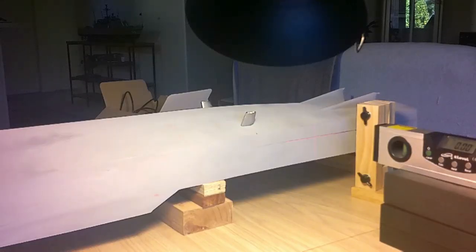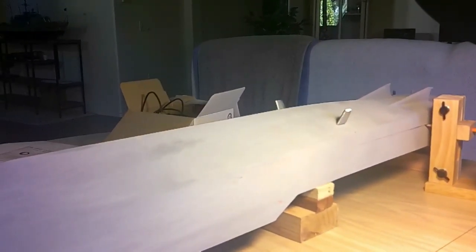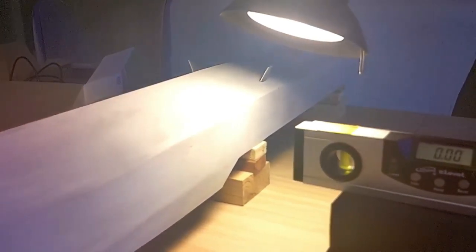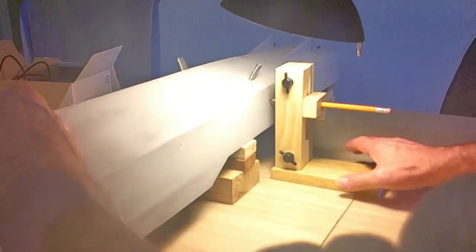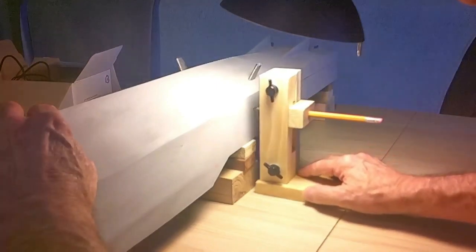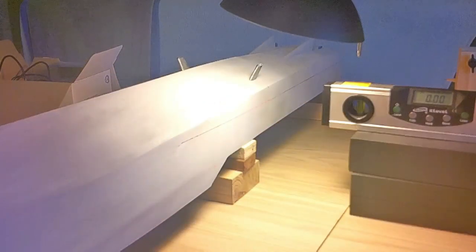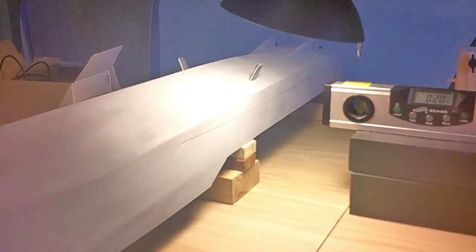Let's get this thing and mark the hull. Laser's on, it's zeroed out. I hope you can just barely see that. It's set. Here's another mark — I went ahead and just marked it right there. I want to check it with my level. Checked it at zero, leveled it out. The laser's indicating right on that line that I marked. Let's go ahead and mark some more. Real quick check of the level — it's zeroed, laser is right on that line we marked. Our tool works. Fantastic.